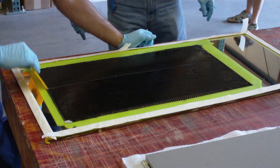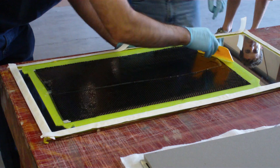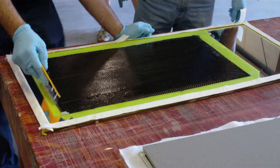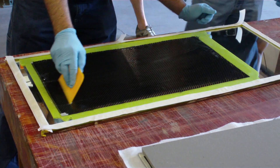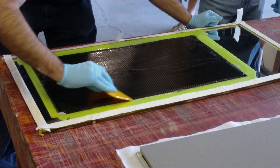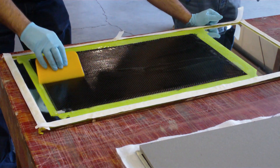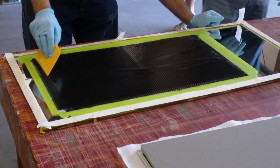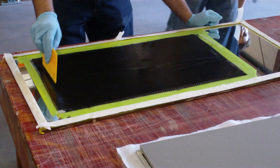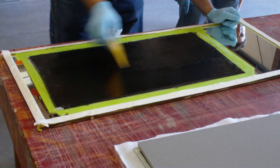Part of what we're watching here is we kind of want the pattern of this cloth to come out fairly straight. And actually, if you're doing a performance part, fiber orientation is really important. I had masking tape around the perimeter of the cloth, and part of the reason for that is so it would hold its shape better as we moved it. On that panel, there's actually a spot in the corner where the fibers are all screwed up — and I didn't tape it this morning.